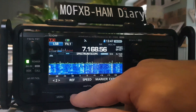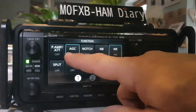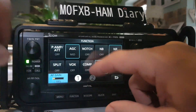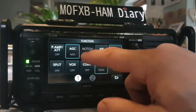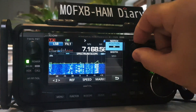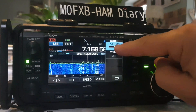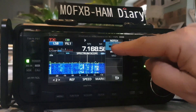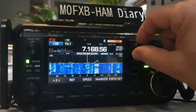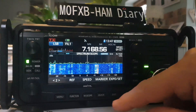Go to function, go to menu number one. You've got AGC adjust there, but you've also got the notch — you tap it to toggle the notch. If you hold it you can adjust the notch right and left. If you hold your finger on this — with any function — it will put the notch up here and you can adjust it with your multi-knob. If you want to go back to its original use, just tap again. So that's pretty good.